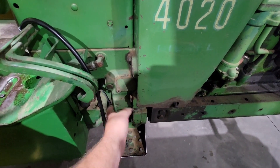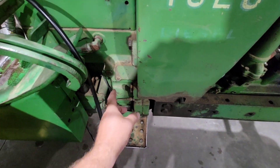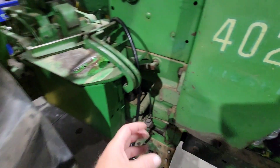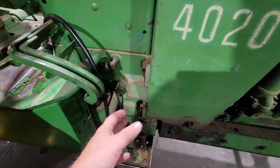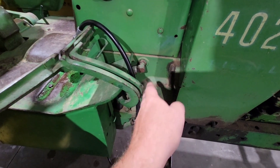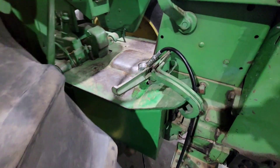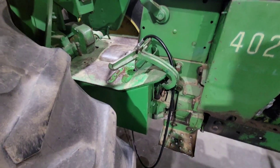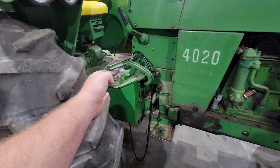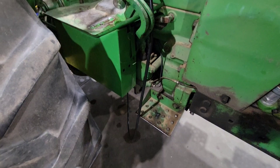Here's your clutch split - on a dry clutch there's your flywheel and dry clutch in the housing, but on a power shift there's just a torsion plate. On the 4020 there are fingers but it's not used with the clutch pedal. Back in here is your clutch pedal - you've got C1, C2, PTO, transmission pump, everything in this clutch pack. Under that is your transmission, your planetary pack that makes your speeds. At this point there's nothing telling me there's anything wrong with that stuff.